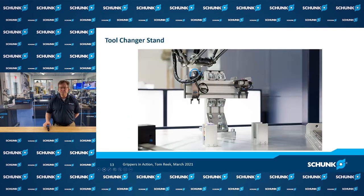For some cases, here we're showing a tool change stand with two different grippers set up for two entirely different workpieces. When you finish processing the first workpiece and move to a second different workpiece, the robot can dock the end-of-arm tool, set it aside, grab a totally different end-of-arm tool, and be up and running. This is illustrated by a tool changer stand where unused tools are stored and new tools are fetched using the robot and the quick change.